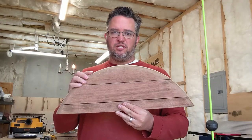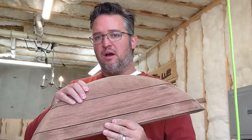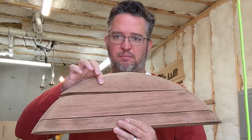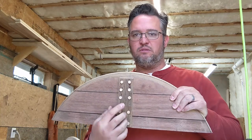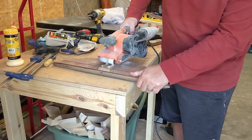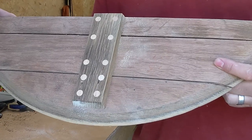Next I'm going to start putting the shelf together. This shelf will be attached to our wall piece, and we have the same issue with this piece where it's going to want to come apart. I finished the bottom of the shelf by taking a scrap piece of barrel stave, marked out my holes, pre-drilled, plugged, and glued them. Then I'll take my belt sander and sand all these down, which leaves everything looking nice and clean.